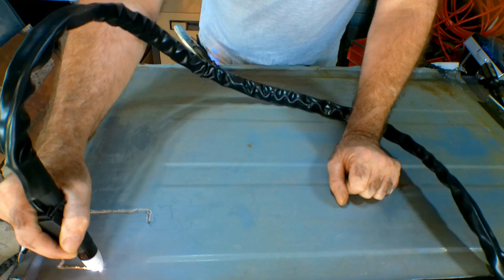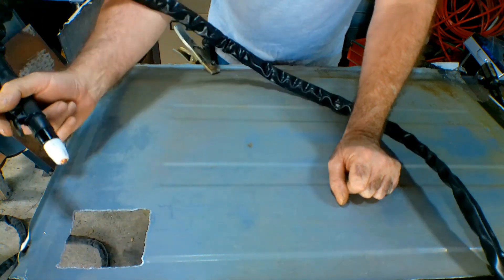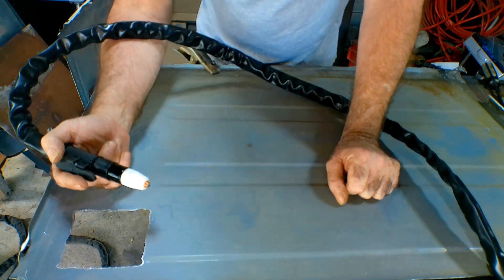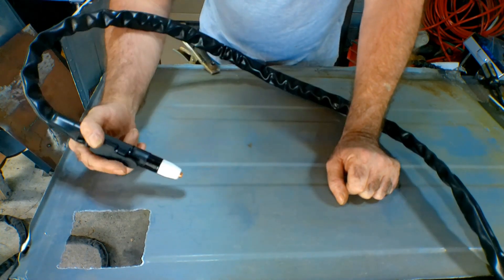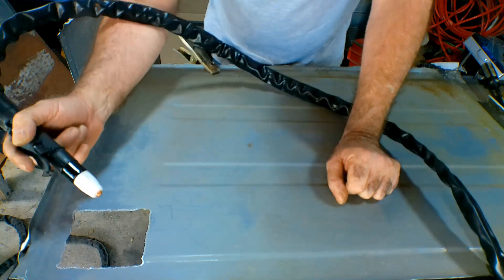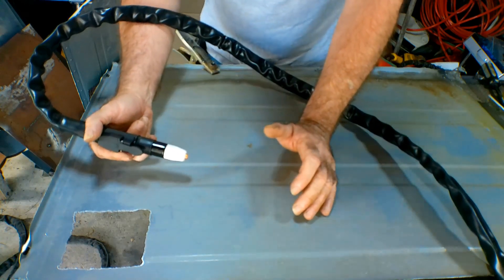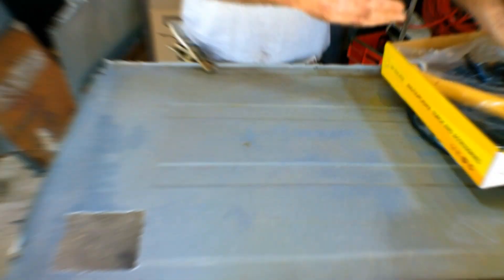If your CNC looks that shaky, you'd want to get rid of it — it's got the DTs! Anyway, that gives you a general idea of what's going on. This is the pencil torch — a nice little torch and cheap as chips too. You're looking at 30 or 35 bucks for a torch, lead and everything. This is not for pilot arc; this is just for a drag-tip torch. But I do have another torch I'd recommend — you can use it on 50 amp, though 60 amp would be better, and that's the pilot arc torch.